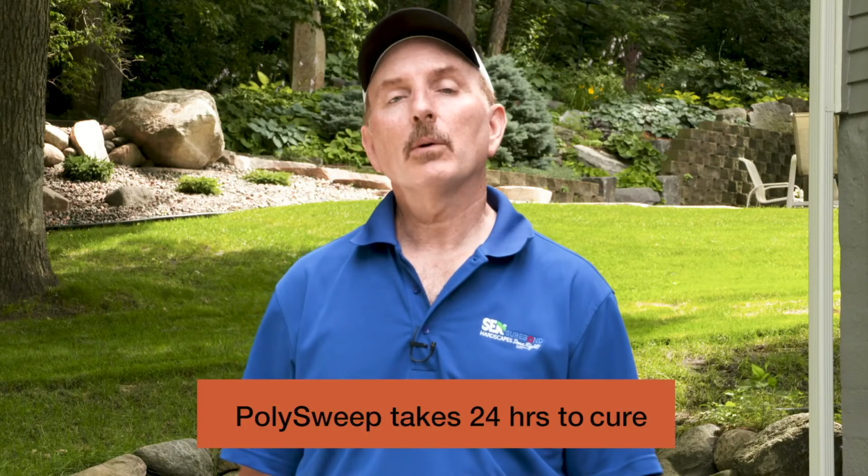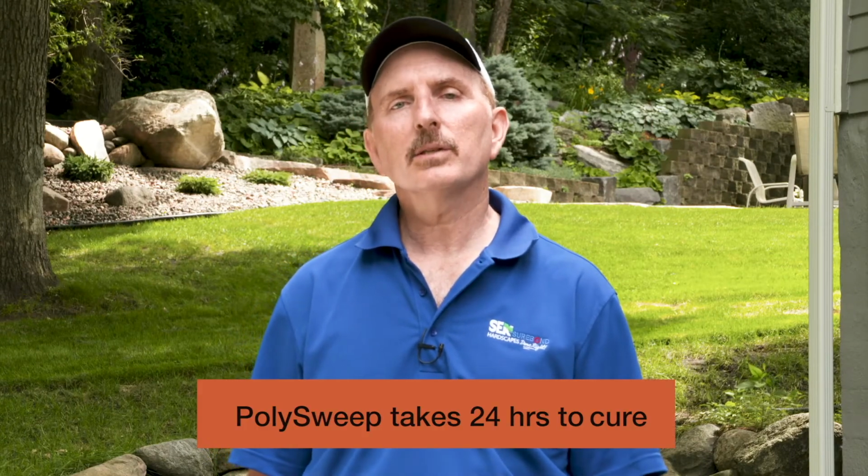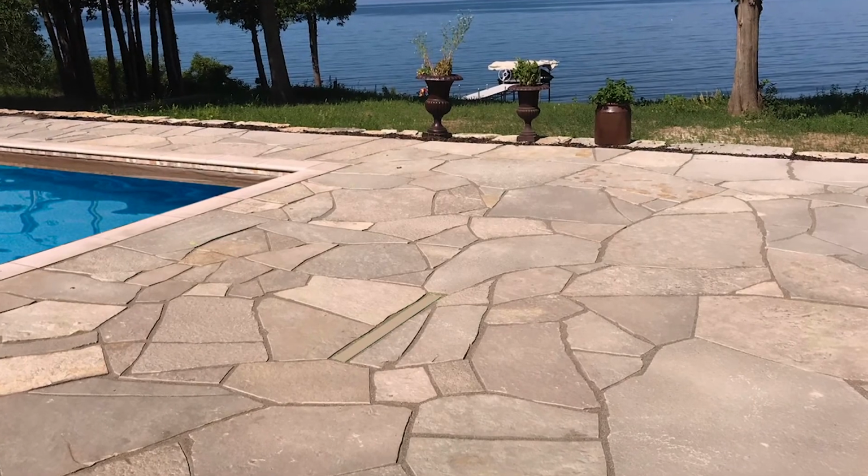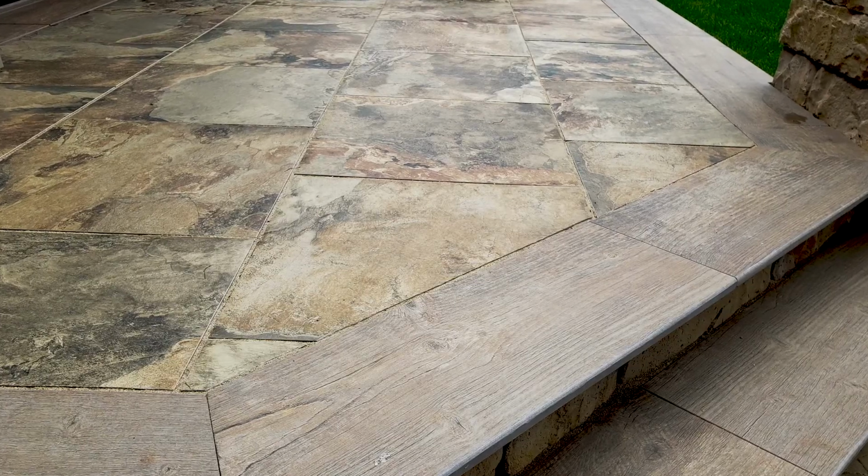PolySweep takes 24 hours to cure depending on site conditions, temperature, and humidity. Once it's dried and cured, it's time to enjoy your beautiful hardscape. You can also use PolySweep on natural stone, porcelain tile, and concrete overlays.